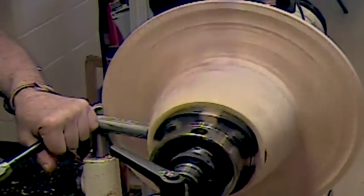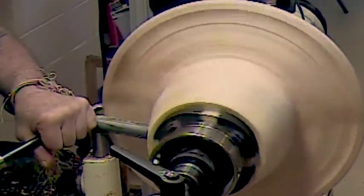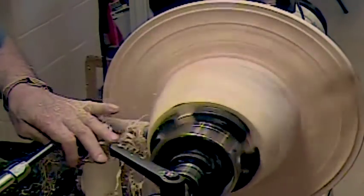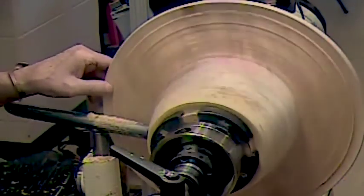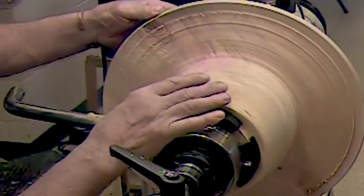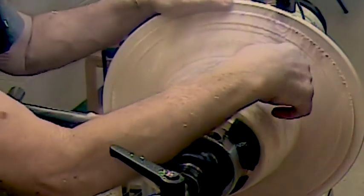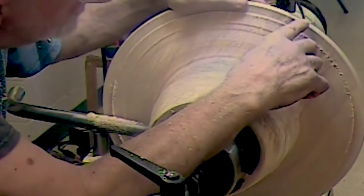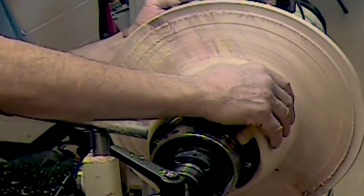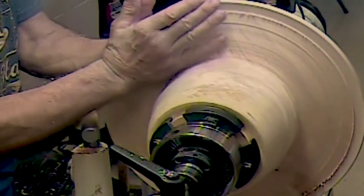So I'm going to square up this edge of the brim here to the travel direction of the brim. Shape here, so I can stop and see where that pith crack is. If we got away from it entirely, we may have. Putting super glue in it before I do this cut is a good thing. That pith knot that we had, that had little pith cracks in the knot itself, those are all super glued. That should be fine. Now I can move this up, and I'm going to do that from right here, because I still have good mass here.